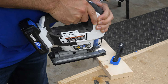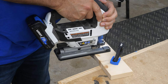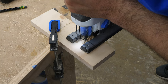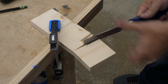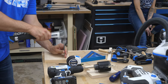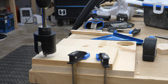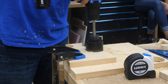When everything was sanded I got to work notching out the dividers. There were no real instructions for this, so I made several cuts with my jigsaw and planned to chisel out the waste — but the pine was so soft that it broke on me. Instead of gluing it back together, I found a hole saw that was the same size as my beer bottles and simply bored out holes for the separate bottles, and that actually worked pretty well.